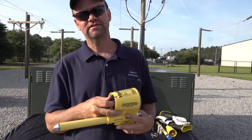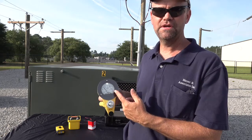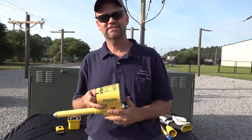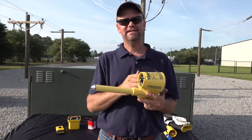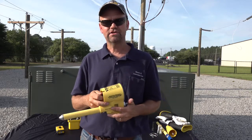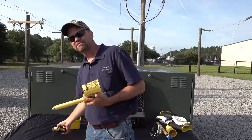The fifth position is the test position — the T position — and what you want to see is a full deflection of the meter scale. This is about a 90% test, basically taking the battery voltage down the probe and back, testing about 90% of the circuitry. We highly encourage that everyone also use a 100% test.